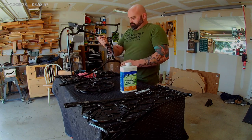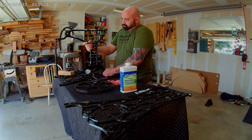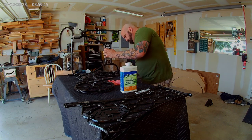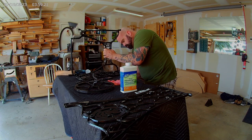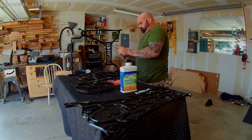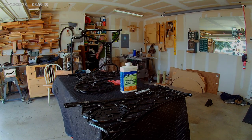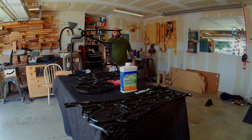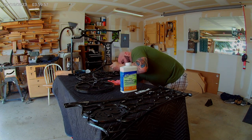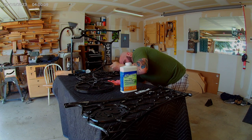The sides of the base are attached with three bolts, flathead of course. I opted not to have each bolt powder coated so it wouldn't mess up the threads, and the guy charged $10 a bolt. I used some super blue bluing on these instead and soaked them in some linseed oil for a few days to really rehydrate them.